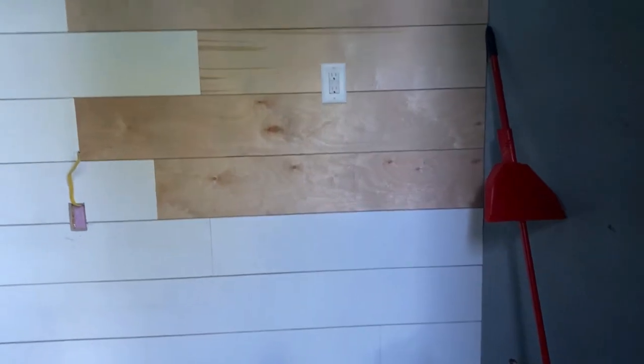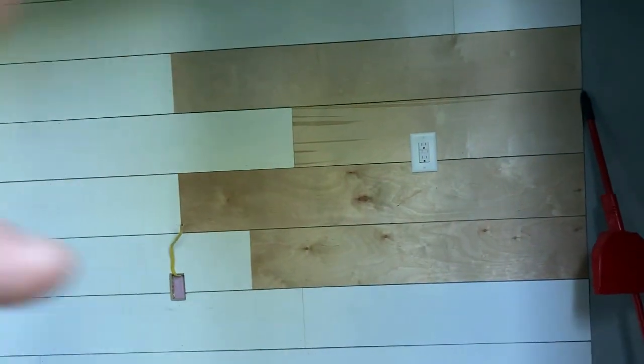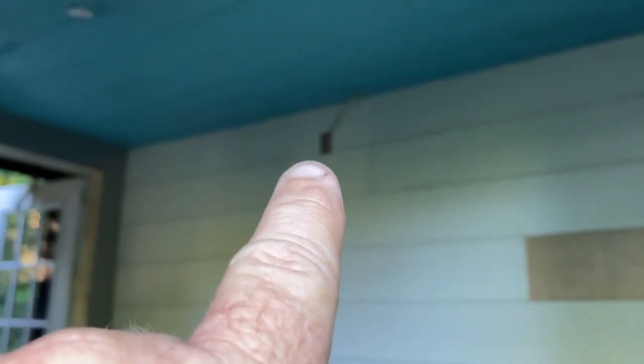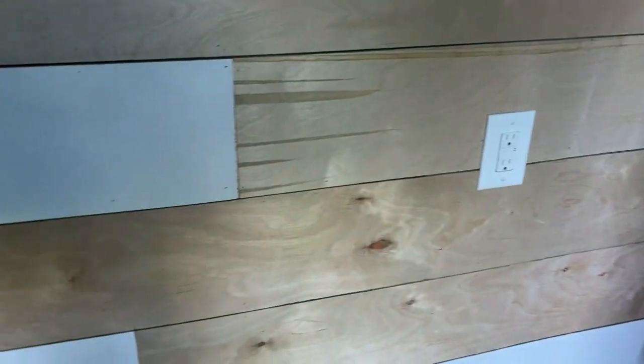While I was at work, she put the shiplap on the wall. This area over here is going to have a backsplash around the counter, sink, and cooking area, so that's why it's not painted. That receptacle in the middle is a GFI because it's going to be around the kitchen area. There's a receptacle for the TV mounted on the wall, and a 110 receptacle for the refrigerator. I still need to finish putting the receptacles in so we can have power in here.